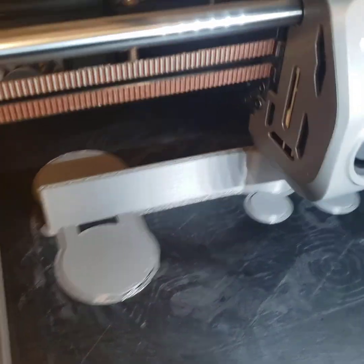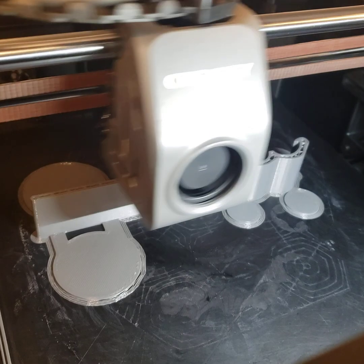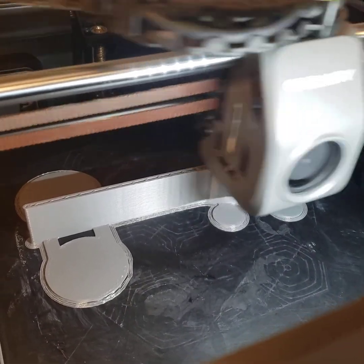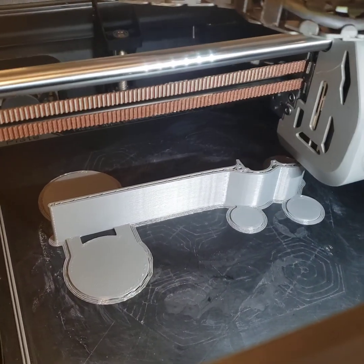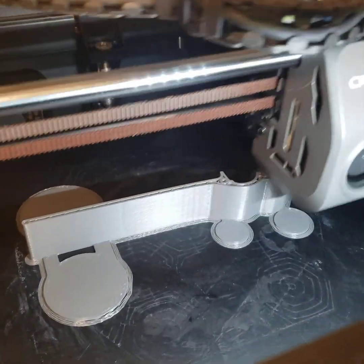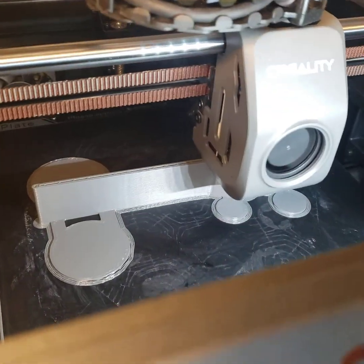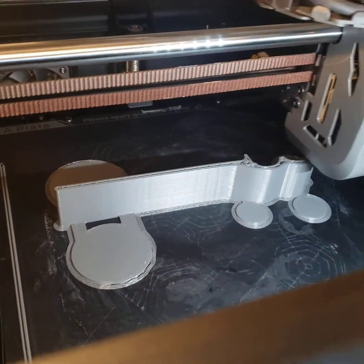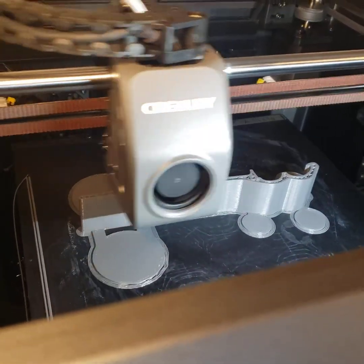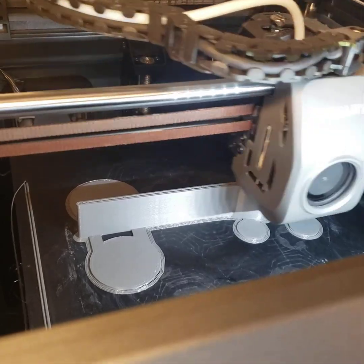Here is the Overture Easy Nylon, a part I've printed out of a bunch of different materials, so it's a good example to compare. I have carbon fiber nylon — same Esun Smart 25% carbon fiber, they also offer a 15% carbon fiber with varying properties. I haven't tried the 15% yet. This is just plain nylon with no carbon fiber reinforcement. I've also printed this shape in ASA pretty successfully in the K1 and other printers.